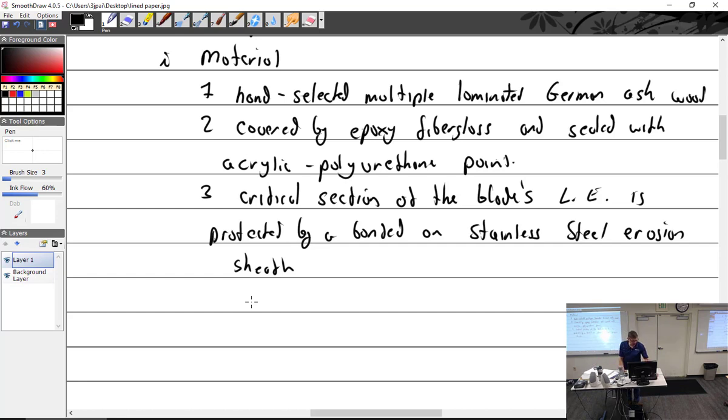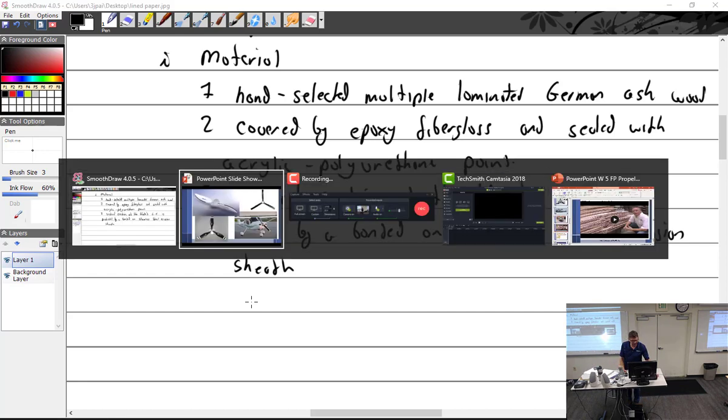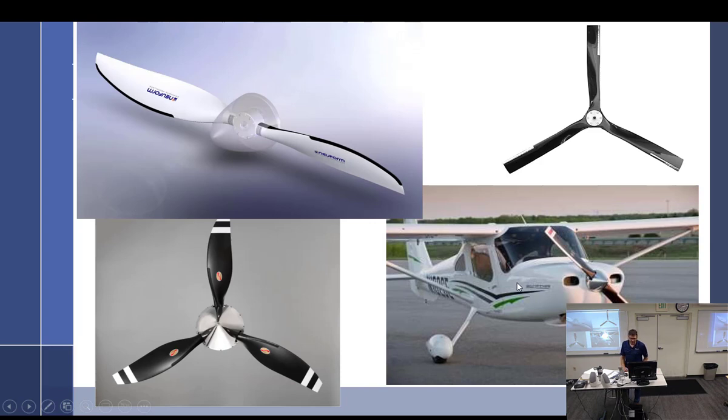The one on the Skycatcher, the Cessna Skycatcher. I know not a lot about them. It's a plastic airplane. Sensenich made one for them as an all-composite two-blade fixed-pitch prop specifically designed for the Cessna 162 Skycatcher's Continental Motors O-200-D engine. The prop consists of a continuous fiber single-piece design giving high strength as well as light weight. This prop is 5'6" in diameter and weighs just 9.3 pounds, which is 14.2 pounds less than the aluminum propeller that it replaced.